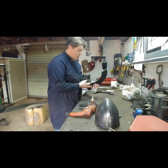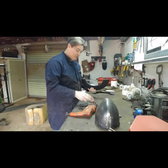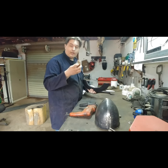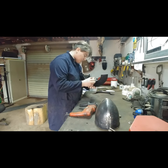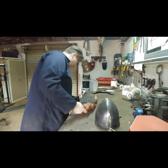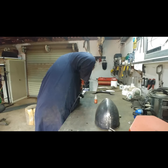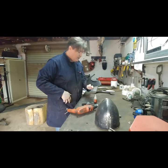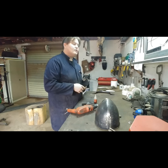Alright, carrying on where we left off — my punch couldn't work, so I'm going to drill out the holes now. When drilling steel especially, I suggest using a cutting fluid or oil to assist with the drill. It helps prolong your drill bits, and those are expensive.